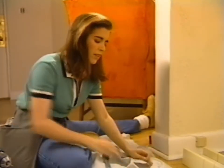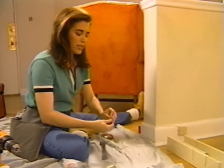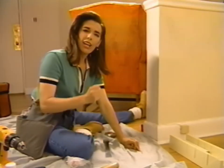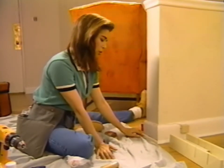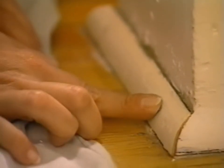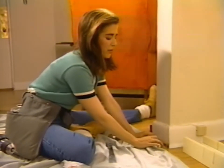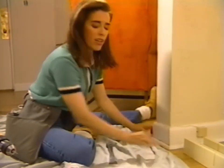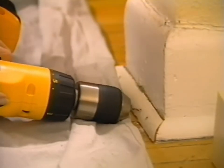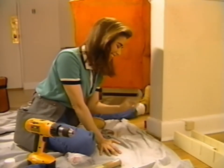These are finished nails. Finished nails — well, there's a bunch of different kinds. This kind is spiral shanked, which means it twists as it moves into the wood and it holds really well. Finished nails all have tiny little heads on them because you don't really want to see them — if they had a great big flat head on top, it would show quite prominently on the quarter round. I broke my drill. This is one of those little easy repairs where everything just goes right.